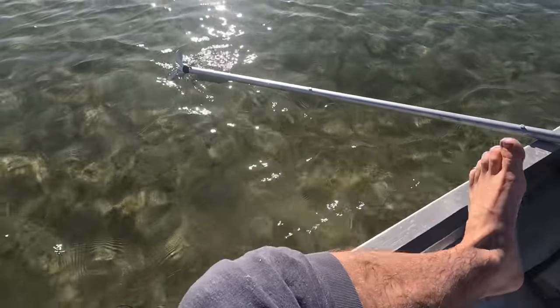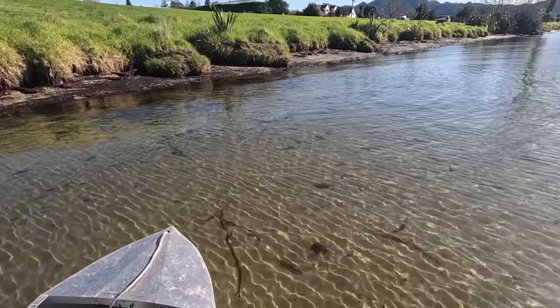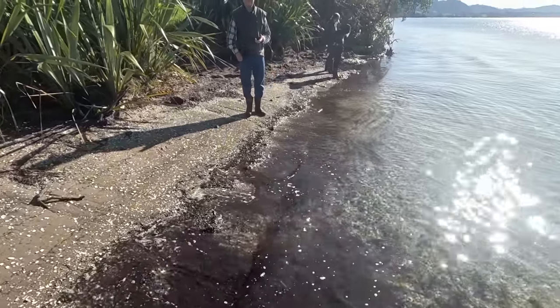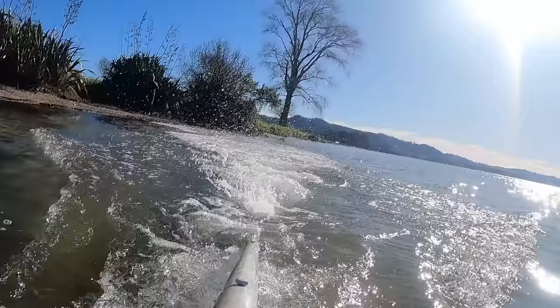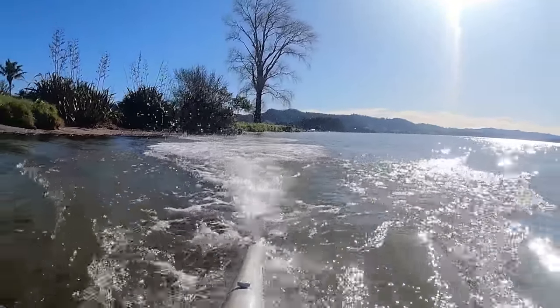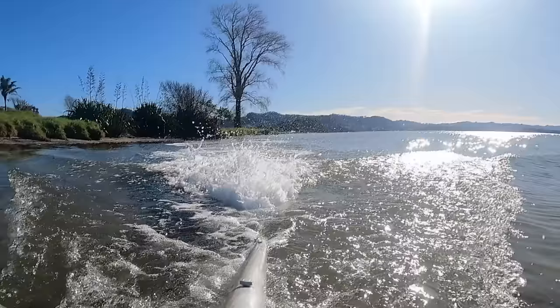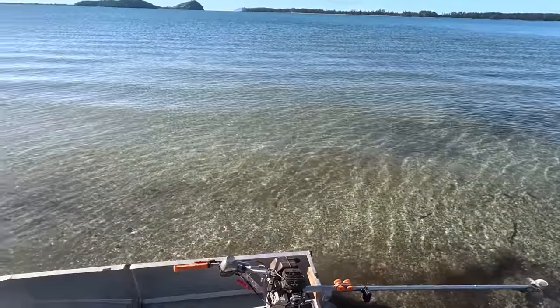Great failure. Yeah, the shear pin broke. Looks like it's not getting enough flow and power. It can't get all the flow. The prop's too aggressive for it. When I tested it in that tub, the tub was only this deep. So when it tries to hook up and go, it's like, nah.